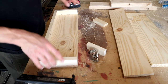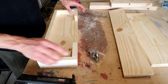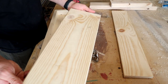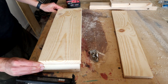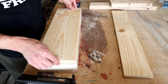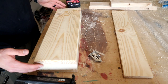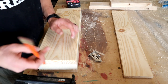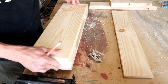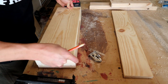Next up we're going to take our two 4-inch pieces and line them up in the two corners. Then I'm going to take my face frame — the little bit shorter piece that we cut — and line it up so that it's flush with the top, centered in there. We should have just about a 16th-inch gap on either side. I'll mark out where these 1x2 pieces will go and leave a little bit of a gap so we're not too tight.